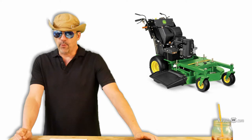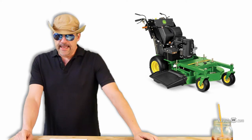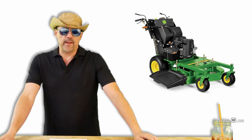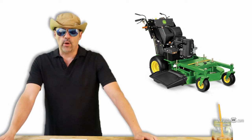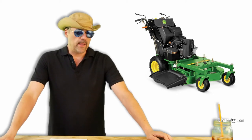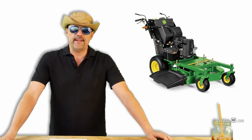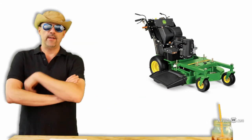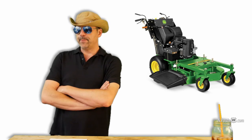I think the pistol grip is a much better option for anyone, even commercial landscapers. So that's basically it — we're happy we went with the hydro, and if you can afford it I would recommend hydros for most people. But again, gear models are great if you have a large flat property and want fewer parts to maintain over time. You do have to change the oil in the hydro, and there are other things that can go wrong — the hydro motors will eventually need to be replaced, just like gears and spindles on a gear-driven model. Either way, mowing hills comfortably is tough unless you get one of those specialized ride-on mowers that can handle a 35-degree hill. This hill is probably close to 40 degrees, and it's just a challenge for a homeowner. I hope this helped — have a good week!